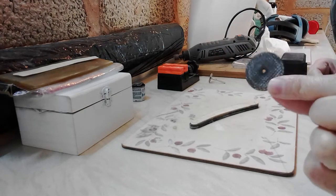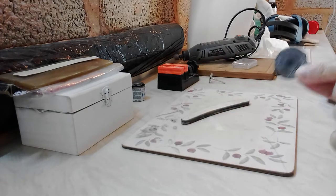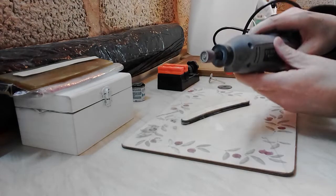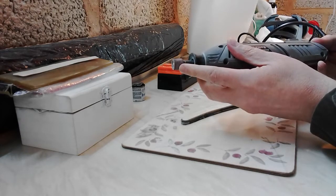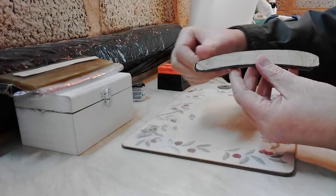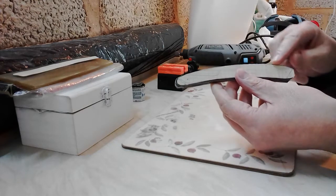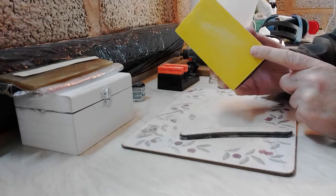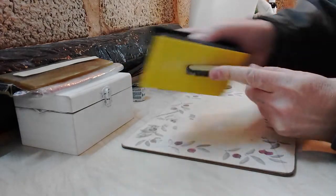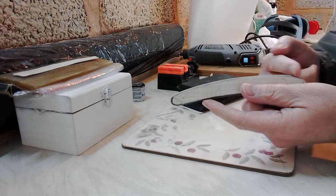It tended to work just in a straight line, so there were lots of little cuts. After it was cut I tried to use this grinder to grind away some of the material — some of the horn — and that didn't work quite as well as I would have liked. But what I've got in the Dremel at the moment is just a 60-grit sanding wheel, and that works really really well to get as close as I can to the template. Then I've been using just a piece of ordinary sandpaper — 80-grit — to get that edge looking right and make sure it's flat on both sides.